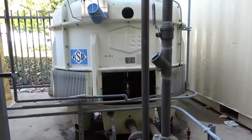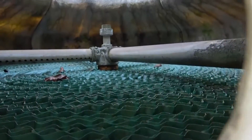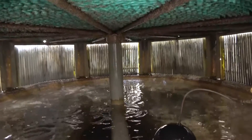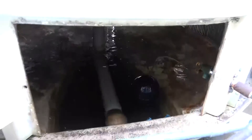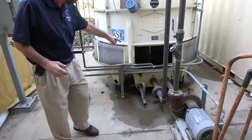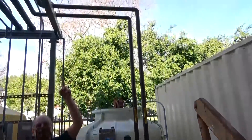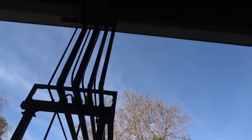If you look right inside here - I'll demonstrate this operating in just a minute - you'll see the bars in there. Those are perforated pipes and the water comes up through the center, then fills these pipes, and as it circulates it drops down through that green packing material, which increases the surface area and gives us a good amount of cooling for these particular engines. Once the water has cooled, it just collects in the reservoir down here at the bottom, comes out through this pipe through the centrifugal pump, and eventually comes over and ends up on the wall over there below the windows, which is where the engines are.